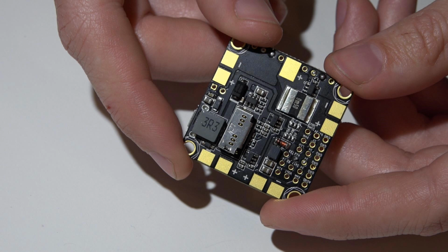But compared to the standard Omnibus, this one, you can power the camera and video transmitter off the board without overheating it or frying anything. You also don't have to worry about the processor resetting itself in mid-flight. But at the same time, like I said, if you rip a pad off of this board, it's now trash, where with the Omnibus, you really don't have to worry about that. And I've also shown you, giving you guys videos on how to replace the voltage regulator and processor both.